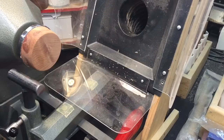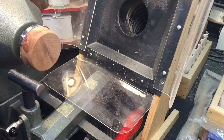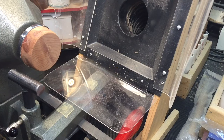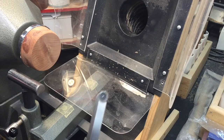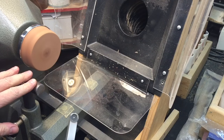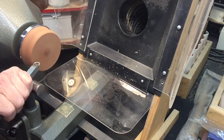We have our lathe set to about 1665 RPM. I'm going to turn on my remote control dust collector — now it's collecting any dust. Cedar can be a little abrasive to the lungs. We're using an Easy Wood Tools round scraper — this is a beautiful tool. We have a small rest; we don't need a big rest. Everything's locked in, and we're just going to make a dome more or less.